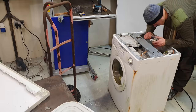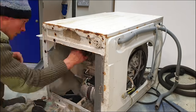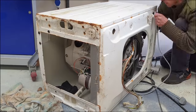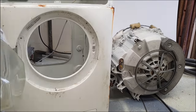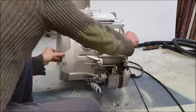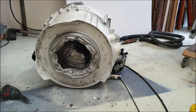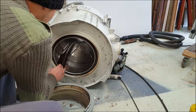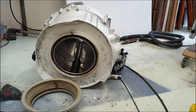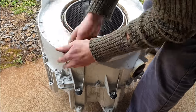If you've seen any of my other videos, you've probably got a sense that I'm really passionate about material-based design, that is, using whatever junk you have to hand, and it's amazing to me how much cool stuff there is inside a washing machine. The ubiquitous series-wound universal motors that come in these things is about 3/4 horsepower, so it can be useful for all kinds of workshop tasks, like running a small lathe or a pillar drill, that kind of thing.